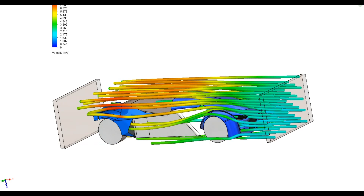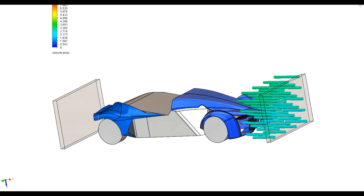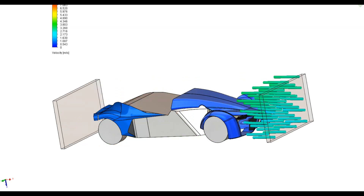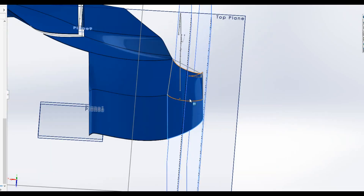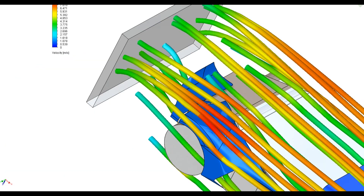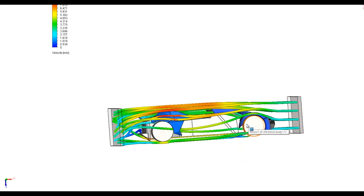After playing around with this a few times, I went and added a rear wing. With the driver in the car and the roll bars at the back, any air that gets to the back is probably going to be turbulating anyway and won't really help a wing create downforce. If I had a really big wing over the top of all that it would help, but I'm not really into that and I don't need rear downforce that badly from a top wing. So I'm going to try to get some rear downforce using a rear diffuser. This wing here is a duck tail wing — it's more about another place for the number plate to mount, more aesthetic than anything, but it does allow me to do more work on the diffuser down the bottom. A diffuser down below creates a lot of downforce in a vehicle.